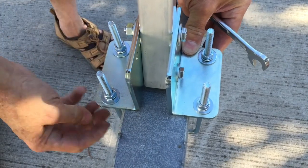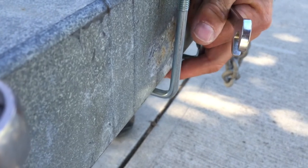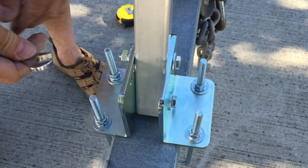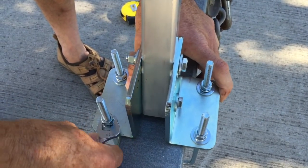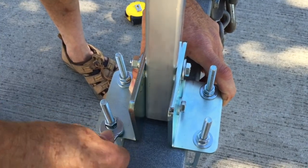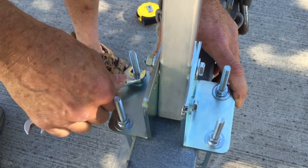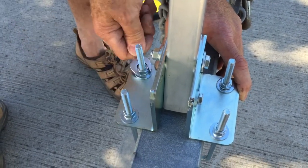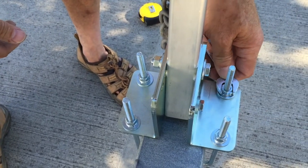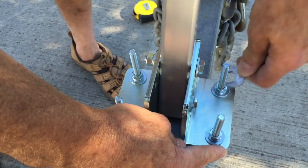You can check by putting your fingers in the gap with the U-bolt and moving it around a little. It doesn't have to be exact but it looks nicer when it's in the center. Then go ahead and tighten it up. You don't have to over-tighten right now since we just want everything mounted in case we have to move it. Don't over-tighten to the point where you start to bend the plates.